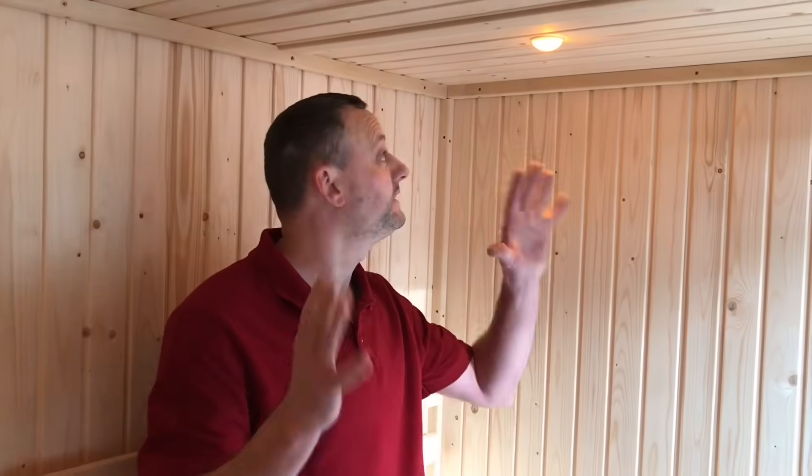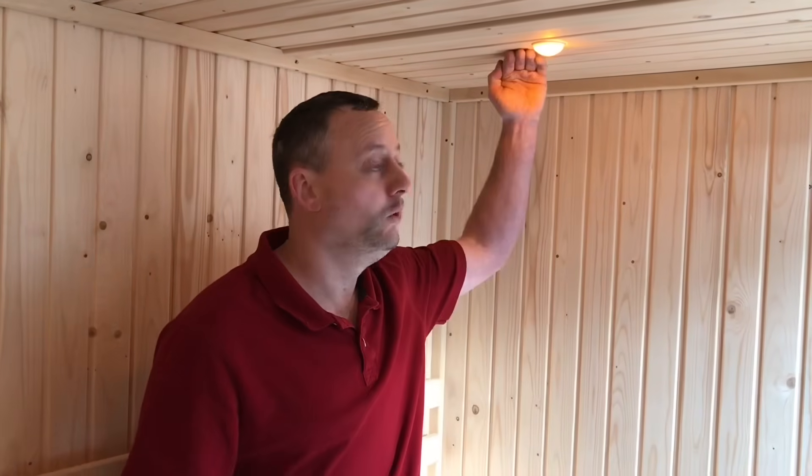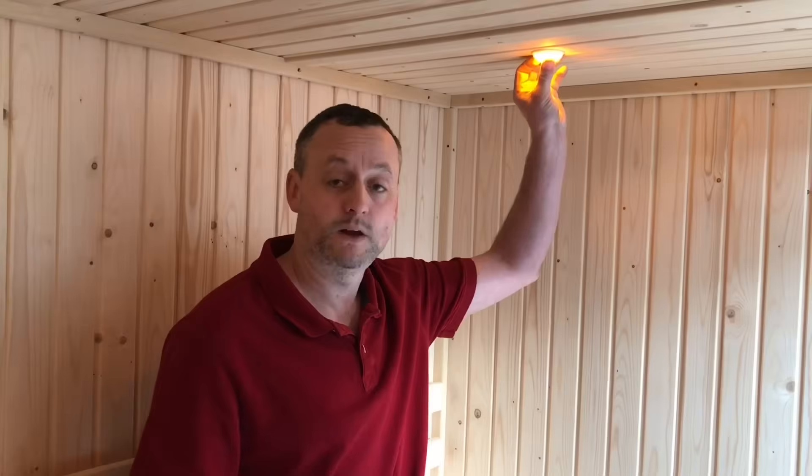It's unlikely to have any other electrical equipment within the sauna and we certainly can't have socket outlets in here. Preferably the wiring system, as in this installation, is installed outside of the sauna itself above the insulated ceiling, so none of the wiring is visible. Any fitting or electrical equipment installed within the sauna must be able to withstand temperatures up to 125 degrees C, so this light fitting must be both appropriately IP rated and temperature rated to a minimum of 125 degrees C.